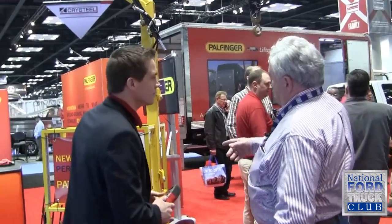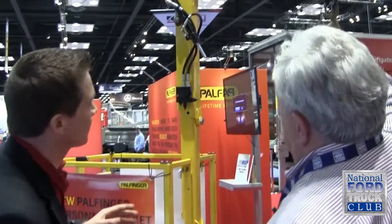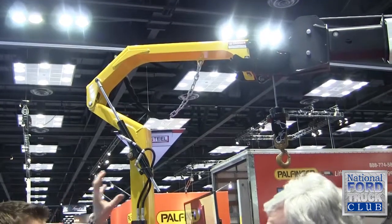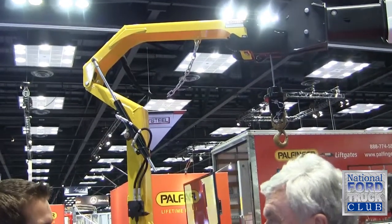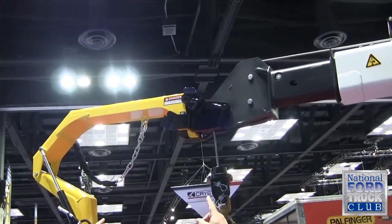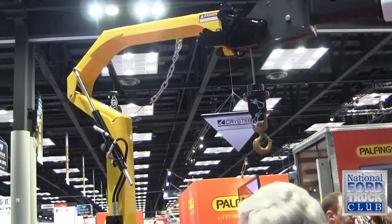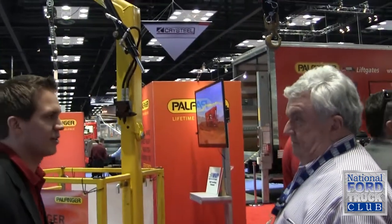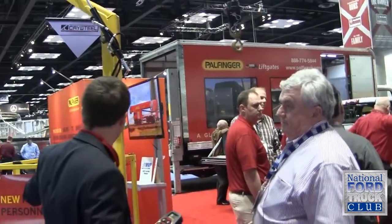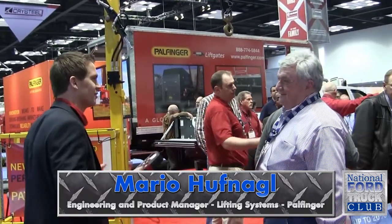There's a safety harness that connects to the crane itself. Yes, everything safety-relevant is integrated in the quick connect mechanism. You can see that loop underneath — that's for the fall arrest. Our intention was to get it as close as possible to a solid crane structure, to be sure in case anything goes wrong with the personal basket, the operator is still attached to the crane and safe.